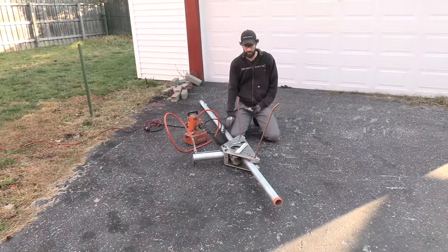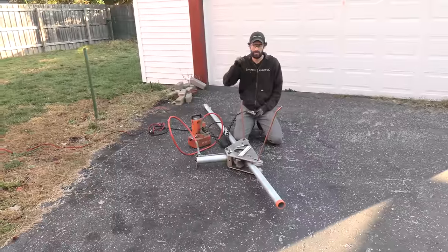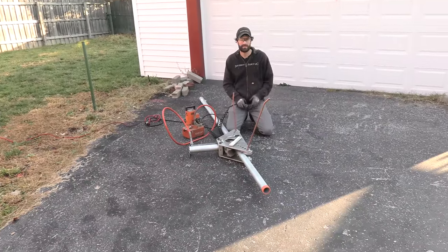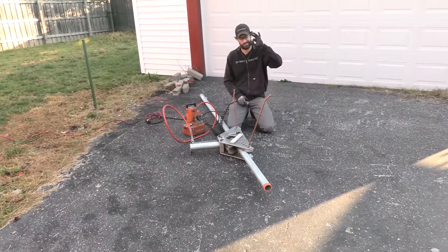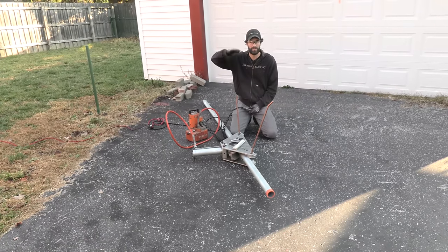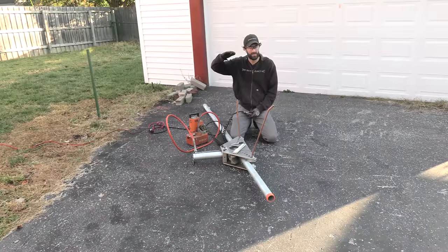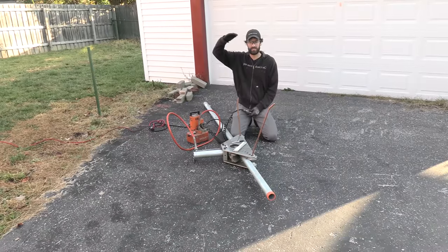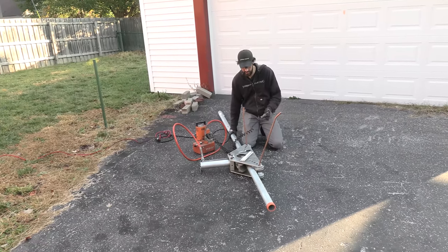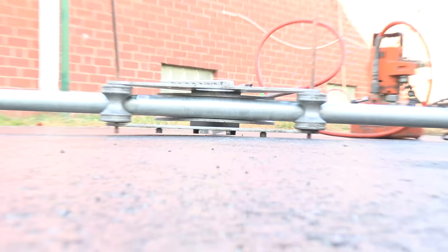This task is one that I perform infrequently. So I wanted to bend the conduit up first and then set my meter base to the appropriate height so it looked right, because I've got a total of 1 foot of latitude based upon the AES Gold Book specification, 5 foot to 6 foot, and that's going to be the grace I need for the lack of precision due to my lack of experience.